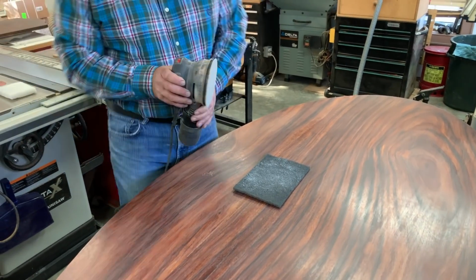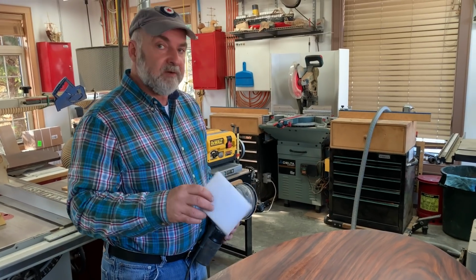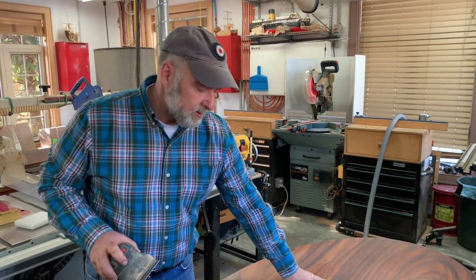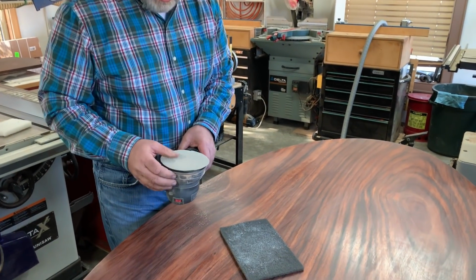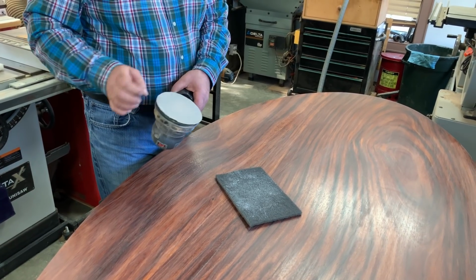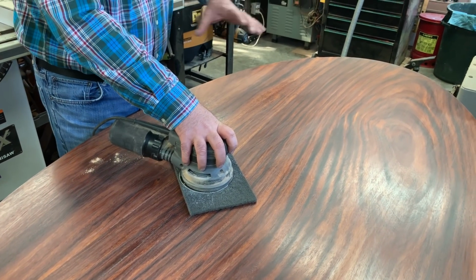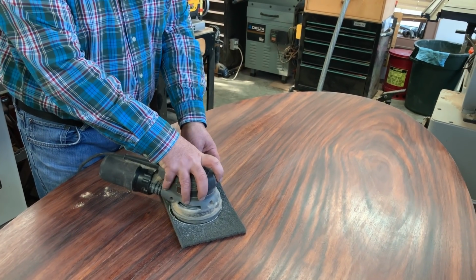It's going to get less so when I use this white pad. And then there's one final step that'll bring out the full depth of grain and not introduce some of the things that I felt before. So, pretty simple, you just throw it on there. I happen to have a sanding disc on here. I could just as easily take it off and just use the Velcro. It doesn't really matter. But you just put this on, switch it on, and that's going to spin the pad and vibrate it. And I'm just going to methodically work from one end to the other until I have everything covered.